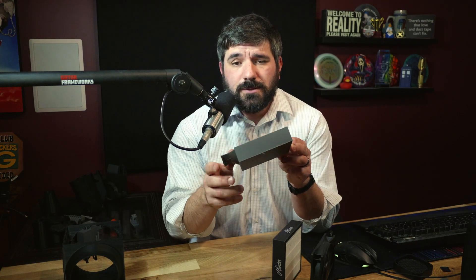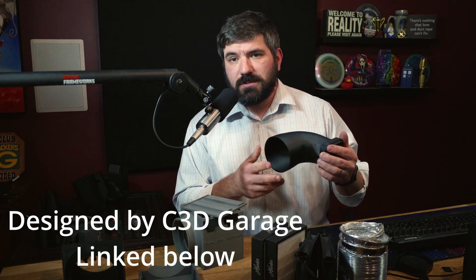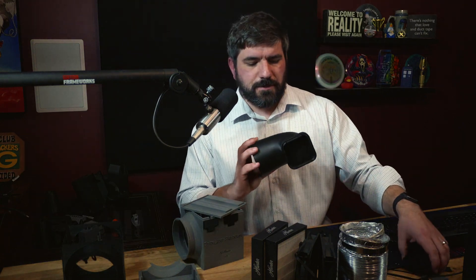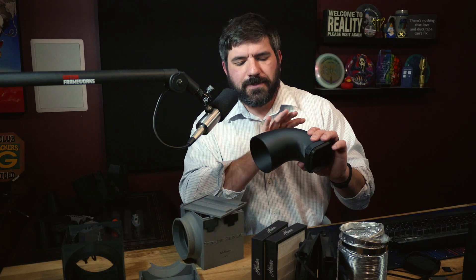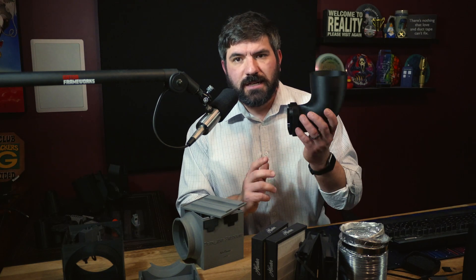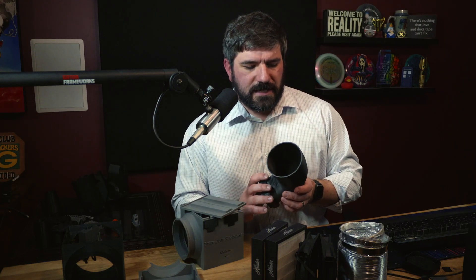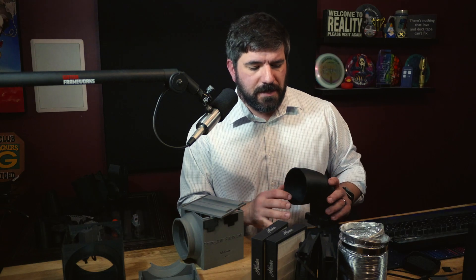This is a K1C exhaust bracket — the exhaust thing that you put on the back — 3D printed, paired with a 70 millimeter 90-degree angle adapter from C3D Garage. I'll have that all linked in the description. If you have a K1 or K1C you'll need to print out two different files. If not, you'll need to find something else depending on how your enclosed printer works, but you will need it to end up at 100mm to work with your four-inch dryer vent.